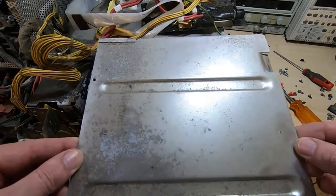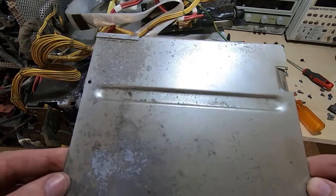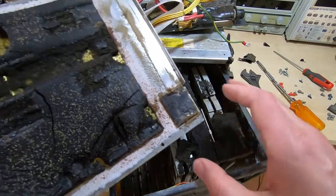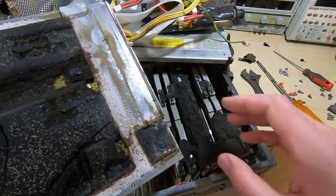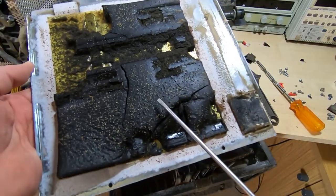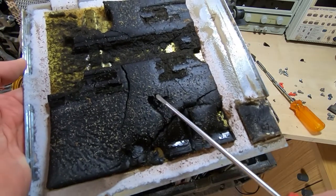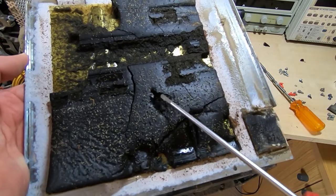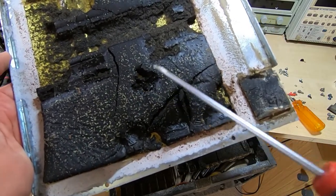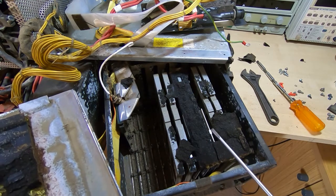While removing the card box, I found something I've never seen before — and I work on these machines a great deal. When I took this off, I found there's normally a rubber pad bonded to the underside of this plate to stop the cards vibrating loose and wagging about when the unit is moved around. But there's actually something growing out of the rubber on this particular pad. If you've seen Techmoan's videos, you'll know that rubber belts can turn to a sort of goo — that's what this has done, it's just like a tarry, gooey substance. But there's actually something like a fungus growing out of it. It's just amazing that something can actually grow in this material — a new one for me.